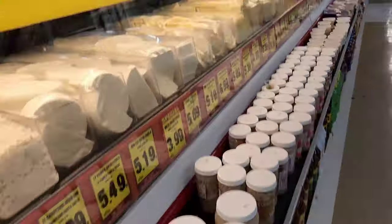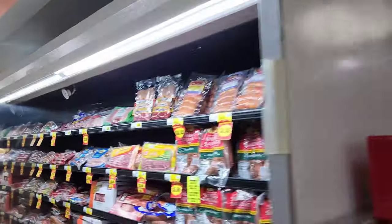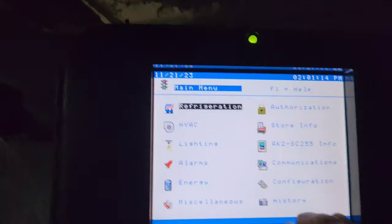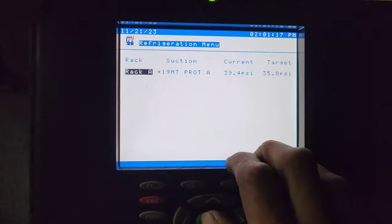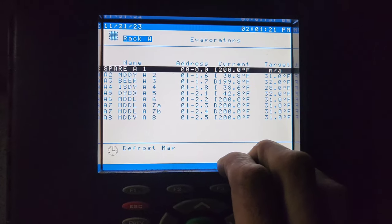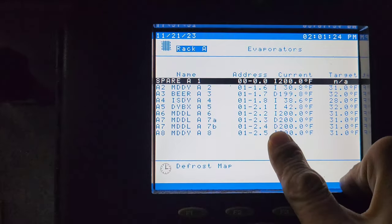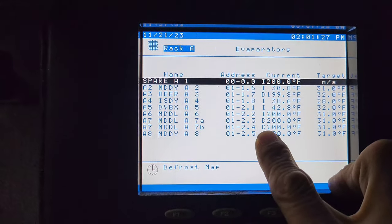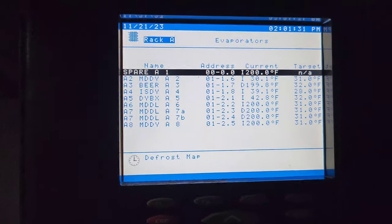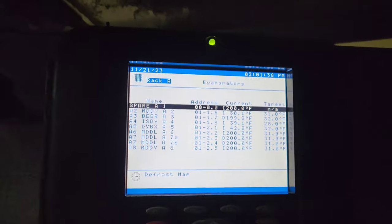You might check for other things, and that's smart. We've got a controller that's perfectly capable of controlling the unit, running defrosts, and monitoring temperatures — but instead, half of them show a blank screen. When you put it in defrost, it doesn't actually put the case in defrost. What's controlling the solenoids are those KE2 controllers.